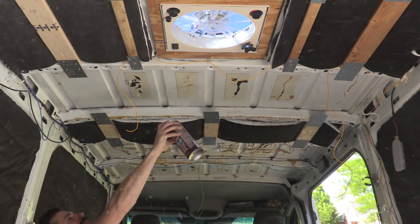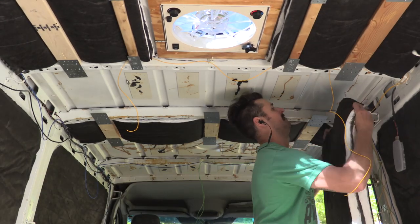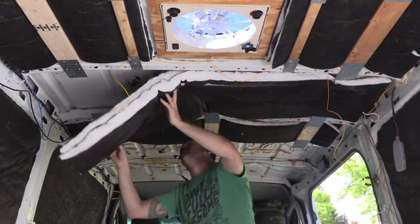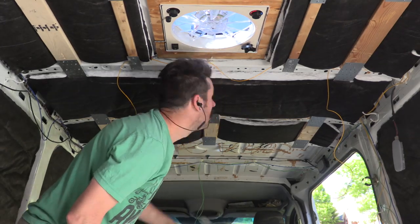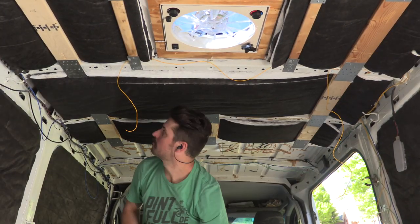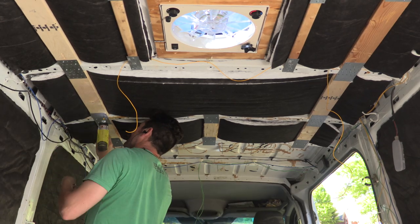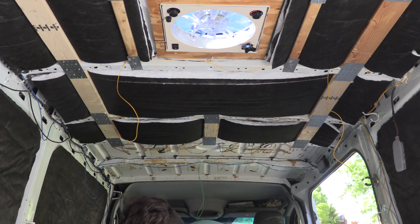For the ceiling, have your electrical and ceiling material picked out and ready to go. Don't do like I did and wait, because at some point your insulation will start to fall off the ceiling regardless of using a strong adhesive. I am adding some furring strips now to attach my ceiling panels, and I'm keeping it simple — my ceiling panels are just white hardboard panels that I got from Home Depot for about $14 apiece.